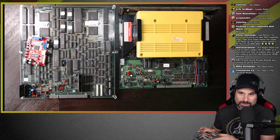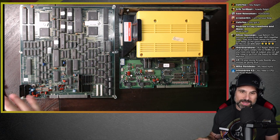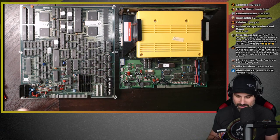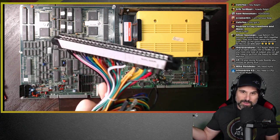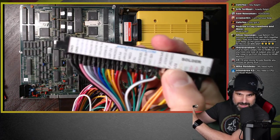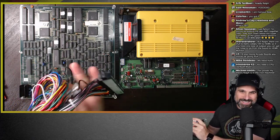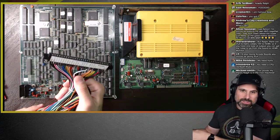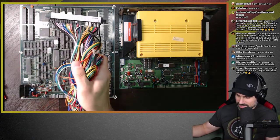So I know this was quick, but just keep in mind: if you're going to use a modern-day display you're going to have to fiddle with it — it's not plug and play. The best way to display these is with a traditional tube CRT monitor. If you want to put it in an arcade cabinet with an LCD, you're going to need to understand these converter boards. Another tip: if you're getting into arcade hardware, I love this JAMMA harness from a company called Press Your Buttons. They label the JAMMA harness in English so you actually know what you're connecting. Google 'Press Your Buttons arcade' and go support this guy — it's a really good idea especially when you're first starting out.